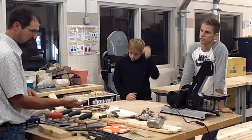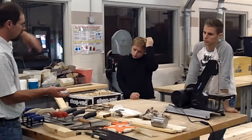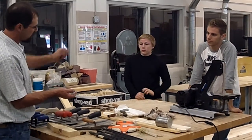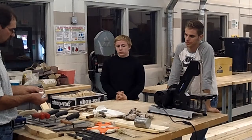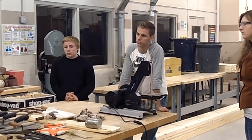It's called fiber mesh, and you get this from the concrete company. Usually they'll put it in for you once they show up on the job. They'll be mixing the mixer around on the truck, and they'll go up there and dump so many bags of this in there, and all it is is little fibers, fiberglass fibers, okay?